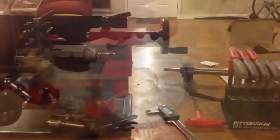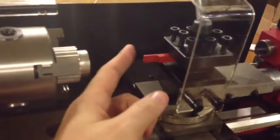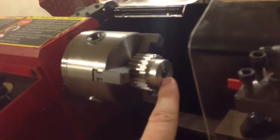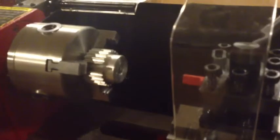We do have one solution coming right up. It is the new Harbor Freight Mini Lathe, and with its self-centering three-jaw chuck, I have the outside chucks installed that come with it. I also picked up a set of tools, and I had to use a little bit of a shim — I had some leftover aluminum — to try to get it to the height of the center. The next thing we're going to do is spin this up and see how well we can get this going. It's the first time I've ever even touched a lathe, so if I screw this little bad boy up, I'll probably just go buy the one that's supposed to fit it. Alright, let's see how it goes.